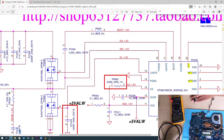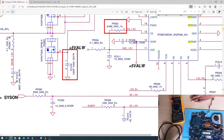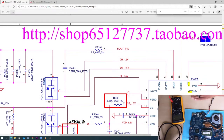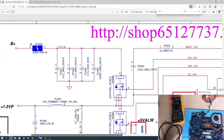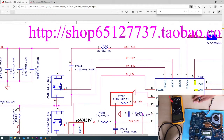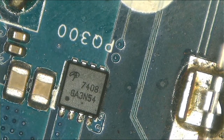Moving forward - the problem might be here: either these MOSFETs are shorted. But to give a straightforward answer, we can't really blame PQ300 because it's connected to the 19V rail and there's nothing wrong with our 19V. The short is more likely coming from PQ301, or from the capacitors here, or from the chip itself, or from another power rail connected to the 1.5V RAM voltage. I'll start by checking PQ301.